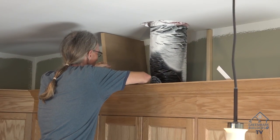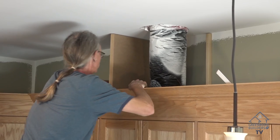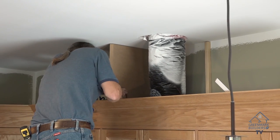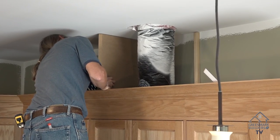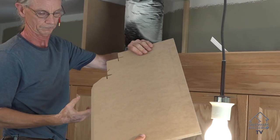Because this one's a little bit wider, what we had to do is a little bit of notching for the crown molding, so the box is actually going to end inside the crown molding, but we want to keep everything nice and tight. So there's a little bit of fancy notching we had to do.